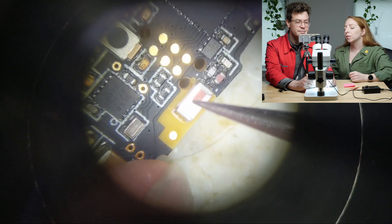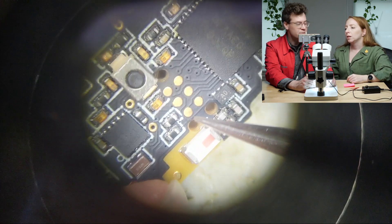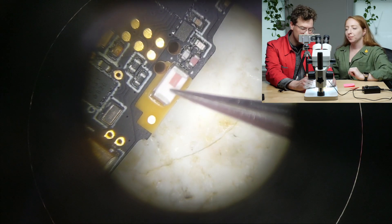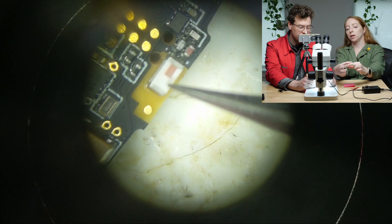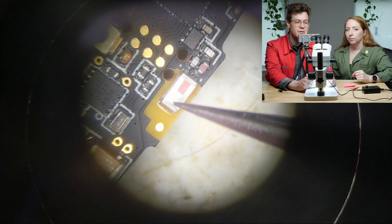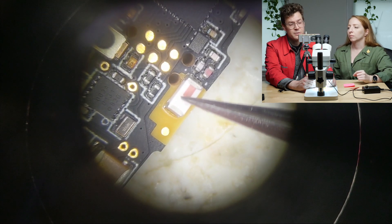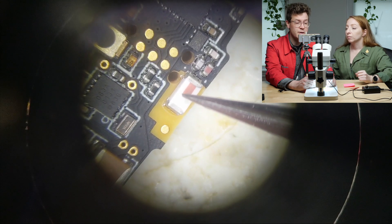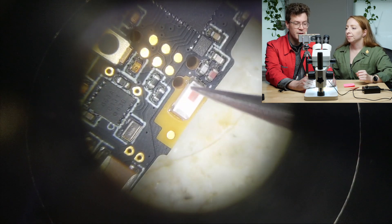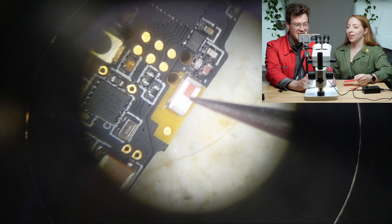That's such a small area compared to that little squiggle antenna you see on the ESP8266 or something like that. Advanced electromagnetics are freaking crazy things. It's on the edge of the board in the middle, where it's covered by the plastic part of the enclosure, not the metal part. They probably spent a lot of time getting this right, because when you're developing a new device which needs to communicate wirelessly, every single thing — from the position of the battery to where the ground plane is, to what's going on with the enclosure, to how people are going to wear it on their body — has something to do with how those electromagnetic fields can get out. So this looks really simple but it probably represents a whole lot of somebody's really hard work. Good job, RF engineers.